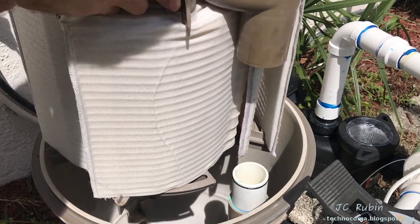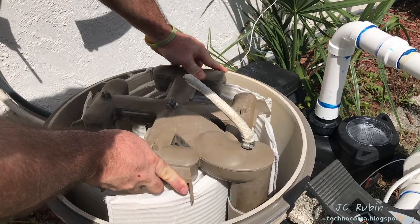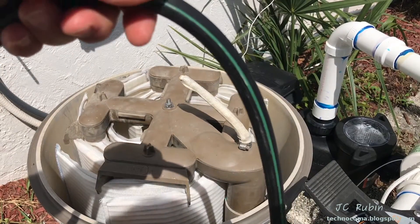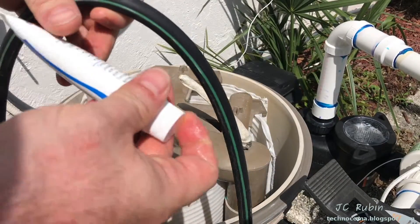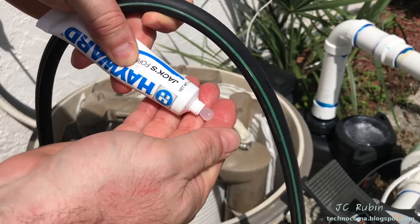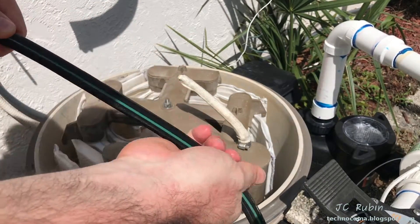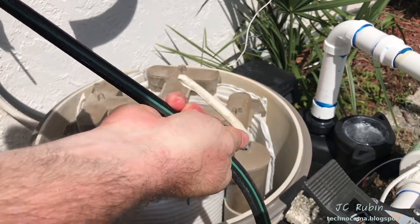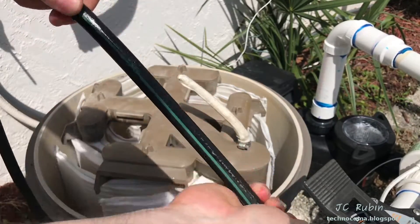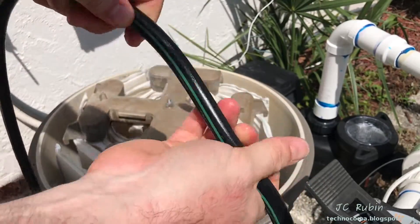Now holding from the lift points, I will line everything up very slowly, lowering the pipe into position. Everything slides down really easily, very nicely — no problems whatsoever. It's back in position. Next is the large rubber O-ring, and this will need to be lubricated as well. This part isn't entirely fun — you just have to put some lube in your hand and walk it around in a circle several times until the entire O-ring is coated. Wipe it off with a paper towel until all the residue is gone because water does not mix well with this lubrication.